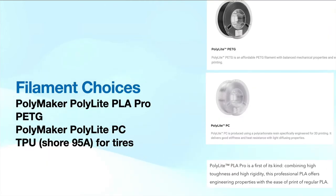For filament choices, I went between PETG and PLA, and different designers will have different ideas. I chose a PLA Pro, which is a little stronger than PLA — it's still a little ductile. PLA can be a little brittle, which is why some choose PETG. PETG has a much higher temperature resistance, so you'll use PETG for motor mounts or small gears — anything that's going to become hot. For the Badger design, I used Polymaker's Polylight PC Polycarbonate, which can withstand much higher temperatures and is much more rigid. It's great for small pinion gears or lay gears. I also used TPU, which is a very flexible filament, for the tires. You're still going to get a lot of skidding with these tires — they're designed for dirt or grass — but for really good tires, you need rubber.